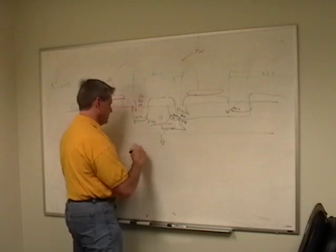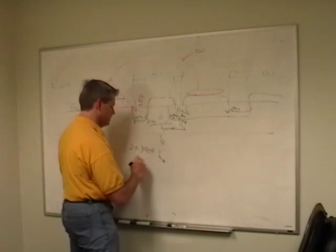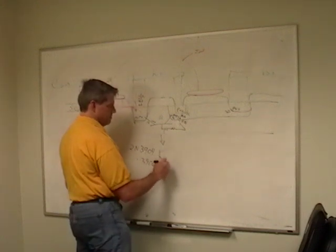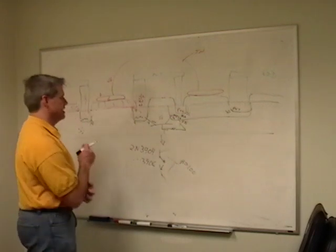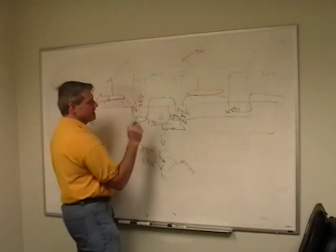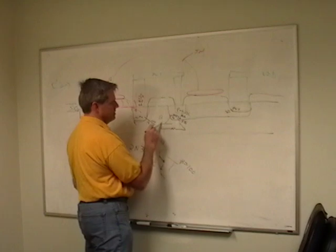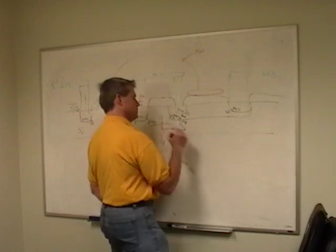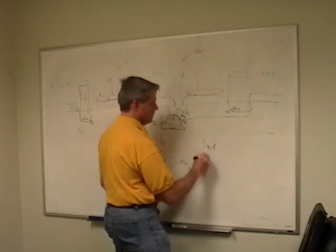sheet for a 2N3904 BJT NPN or a 2N3906, they both have betas of around 100, if I remember right, 99, 95, something like that. So let's think about this. If I manage to get one nanoamp of current to flow into here, so I start out with one nanoamp, but it goes through here and gets multiplied, so now I've got 100 nanoamps.